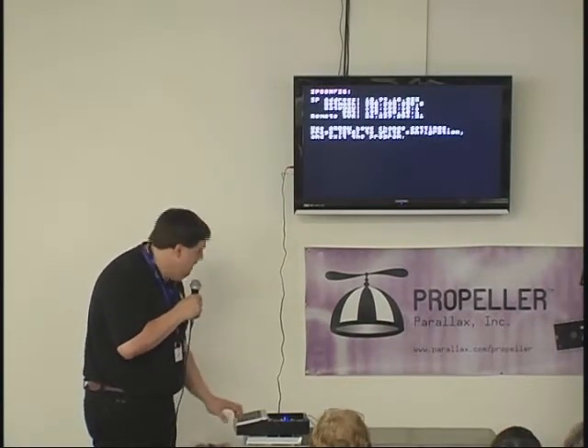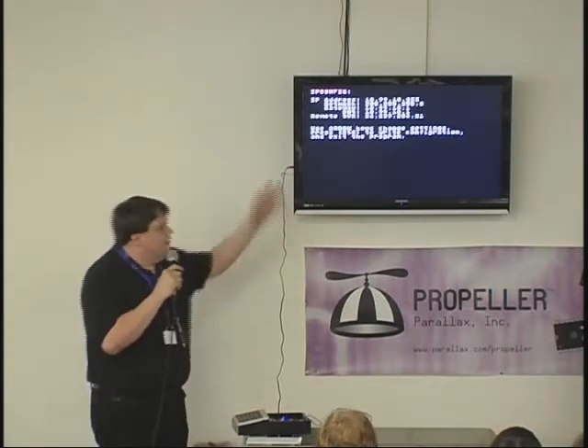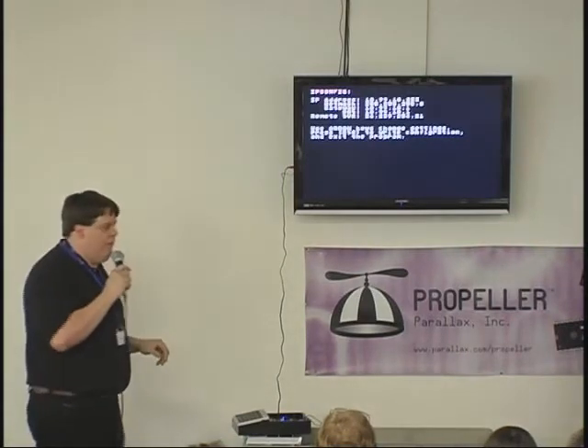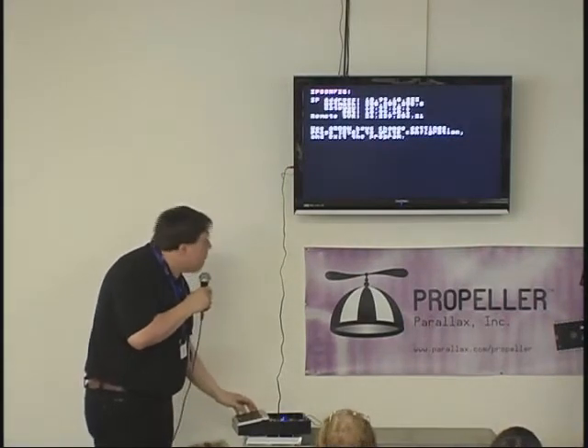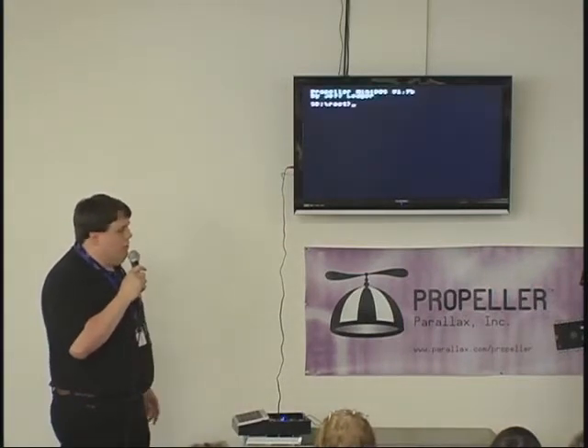No one's got 233. This is a class C network, so I need to set my gateway. The remote server is the server that's running hopefully over in Ohio up in the office. I'm going to hit Escape to write these changes off to my SD card, and I'm rebooting.